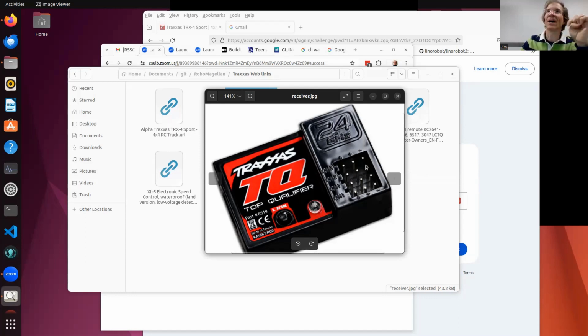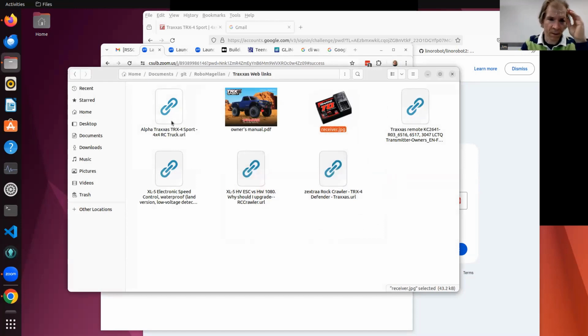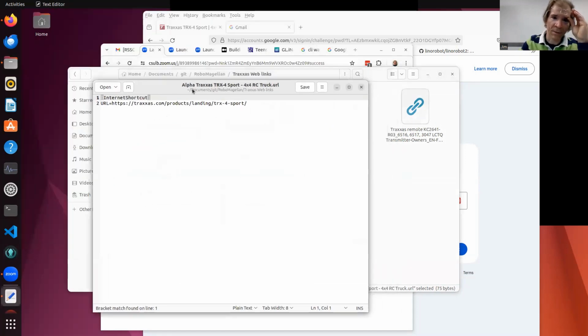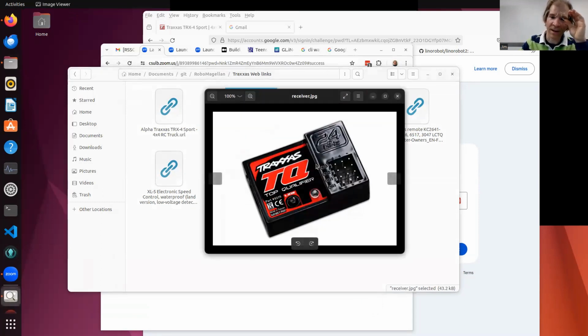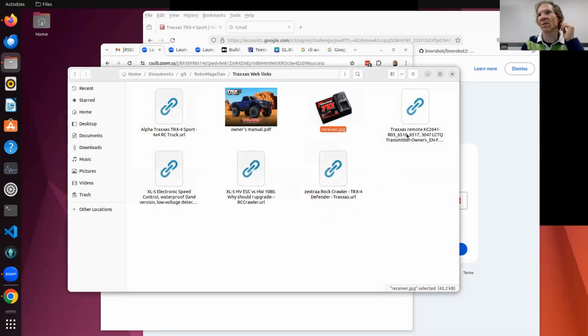And the grounds I had to tie. You have to tie the ground of my battery and their batteries so that the signal will work from the Arduino or from the Teensy. That's an important aspect, ground tying. You look up the specs of this thing, and it already has 4 ports here. So I just put 2 more servos on the load of this, and they're just small micro servos anyway to move the camera.